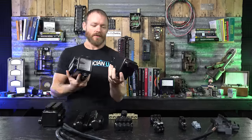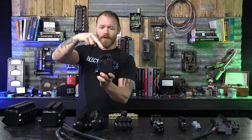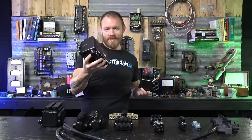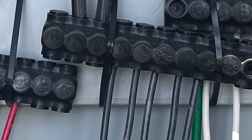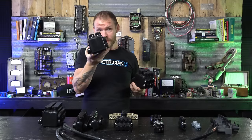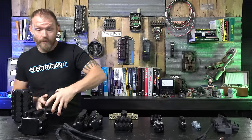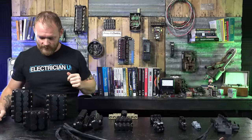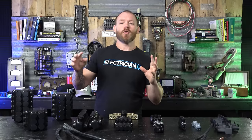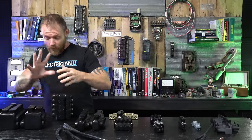There are different configurations — this one looks identical but has fewer conductors. You might have three conductors dead-ending and three passing through, or five going into multiple disconnects for something like an apartment building or an office with five suites, all feeding off the same service entrance conductors. Electricians call these by barrel count: a three barrel, a five barrel, a six barrel.